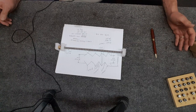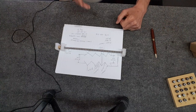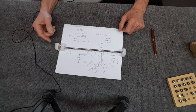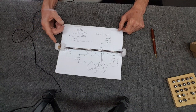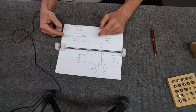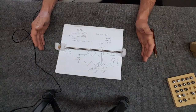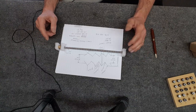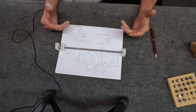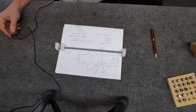It does say it's for a CNC Z axis. It's very, very close. It's the best one I've gotten yet, but it does not work. So the existing nut won't go on it. And I could use this nut, but the bottom nut in the Z-axis assembly, it won't thread into that. So I'd have to buy another one of these from the same source, so I know I got the same thing, and then try to push the bottom nut out and machine this to fit it. So not going to happen.